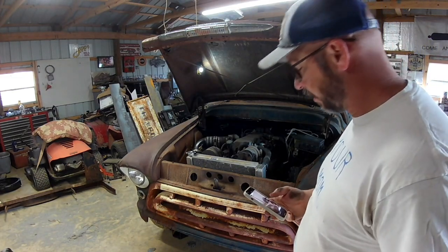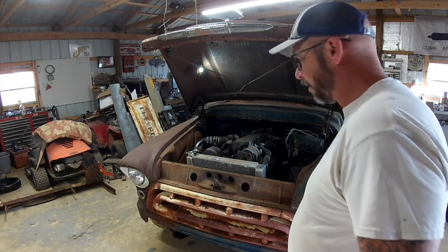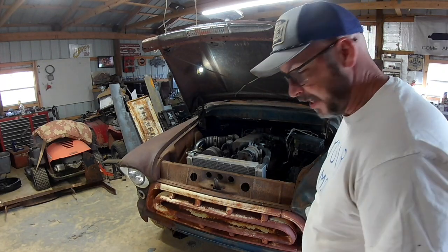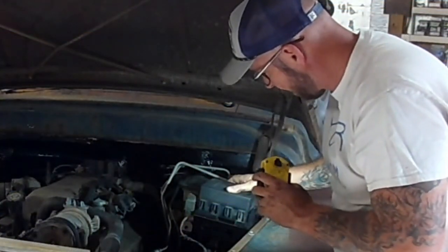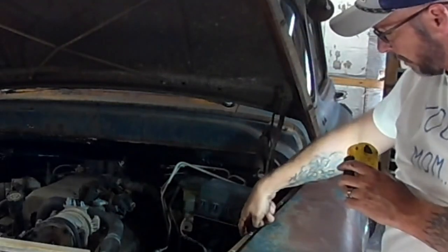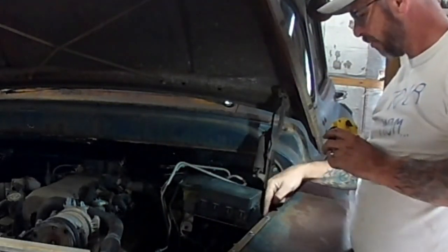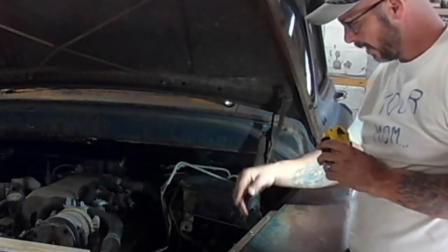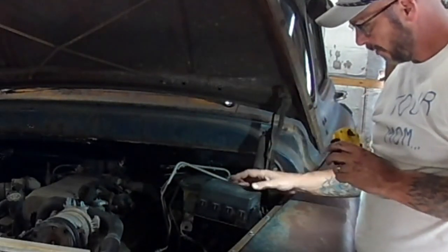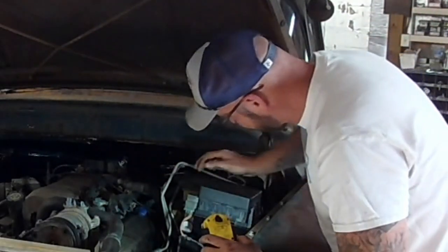Acorns falling off the tree sound like I'm being bombed. But that may have to be good enough for this weekend because we're trying to get it to a car show. So it's probably going to be good enough. Space that out just a little more. Put a spacer in here. And then you probably put 2 spacers on this side. That'll twist it away from here as well as get it away from the hood a little bit. Dang it, I thought I had it figured out.